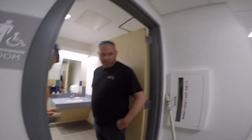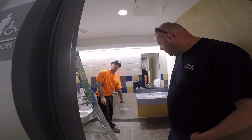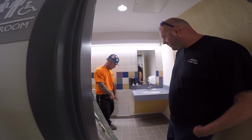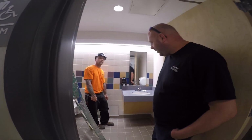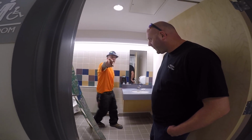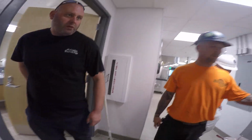But there's an irrigation here. I don't have the key on me, but the shut-off is here. There's also a drain-off if they want to drain it, at the bottom of the leg of this pipe that goes out. The vacuum breaker's just outside. The backflow is right here. So this is the backflow for the irrigation.